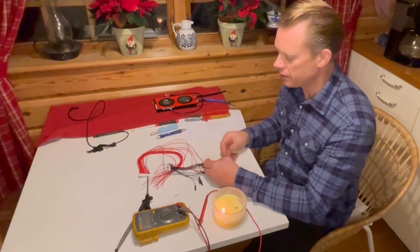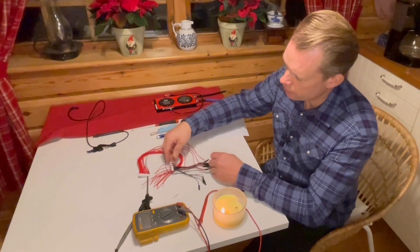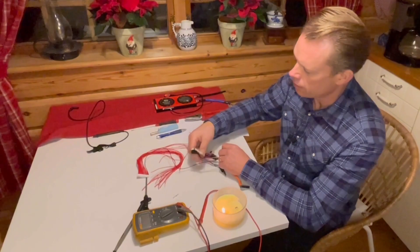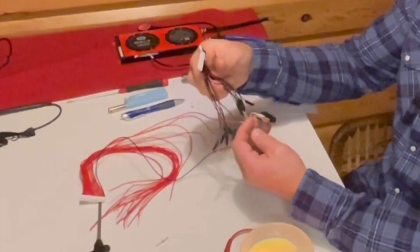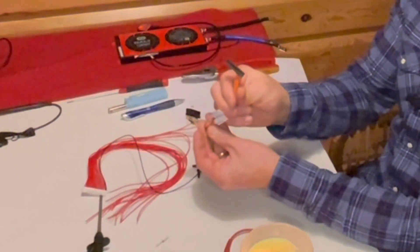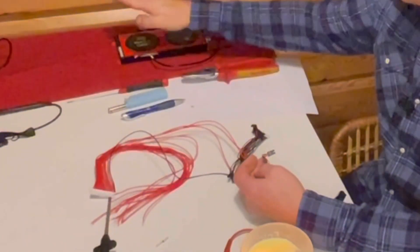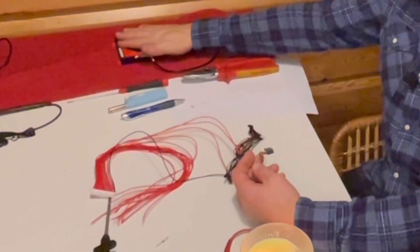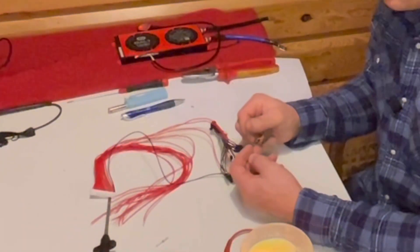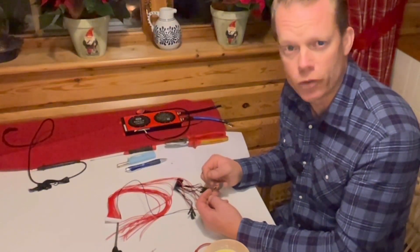With my balance leads, I just need to resolder everything. You might have seen my other videos where I measure cell voltage using this connector. I am going to remove this, and this socket here will fit into my module, and later on this will connect into my BMS. So now I just have to do all the soldering and then verify everything is correctly connected.